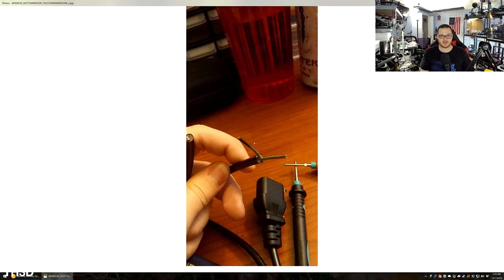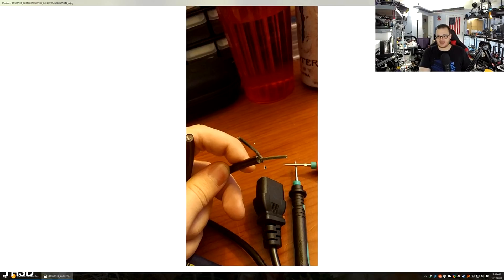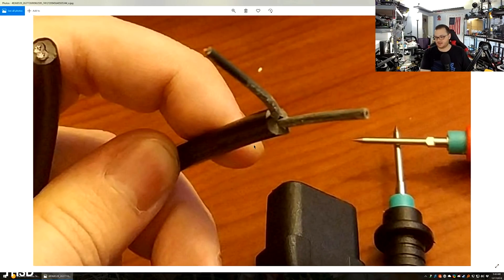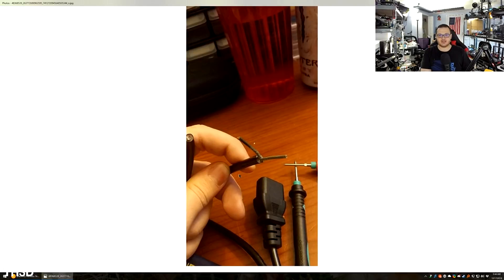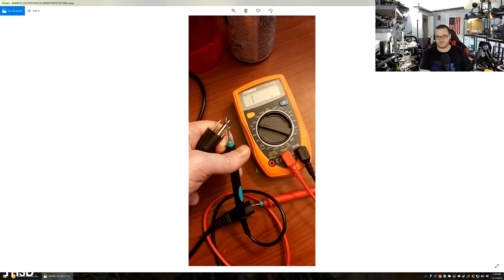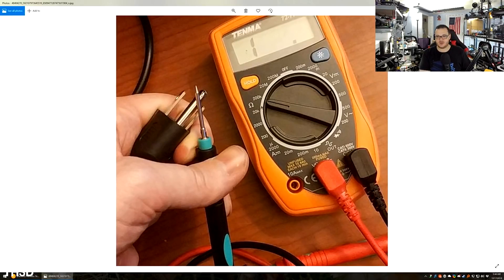One thing I want to show you is the picture that prompted me to make this video. In my brother's case, his cable actually only has two conductors in it — it's not even a situation where the wire was just faulty at one end. His is a completely misrepresented cable. You can see him testing it and it's completely open. He's using the resistance feature: if it reads zero, it's working. In this case it's showing an open connection, meaning the cable is faulty.